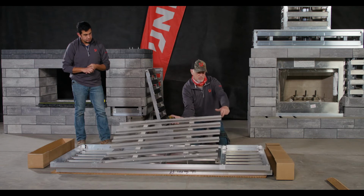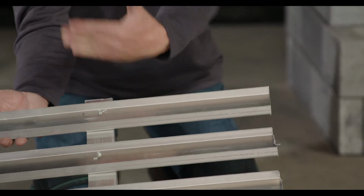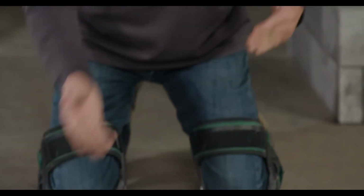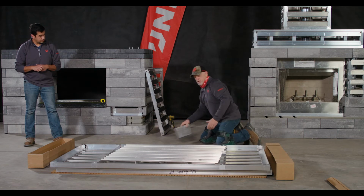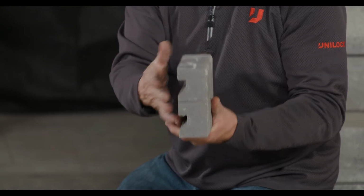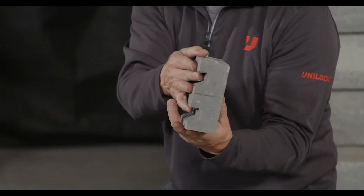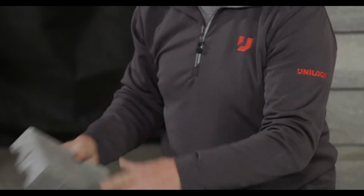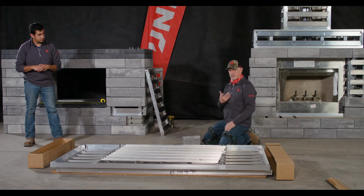Make sure when you do a self-tapping screw here, you position that screw to the top part. The reason is that it falls in the void cavity of the Ucara fascia panels here in the bottom, so you won't have to do any kind of amendment. Your panel should hang true and not be askewed by the head of that screw. Maintaining that position when you reattach this to that backside is helpful.